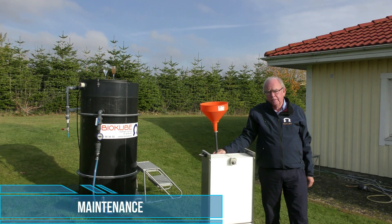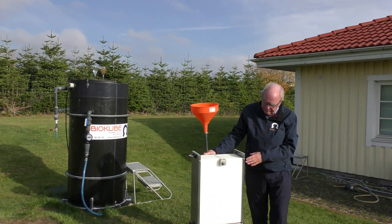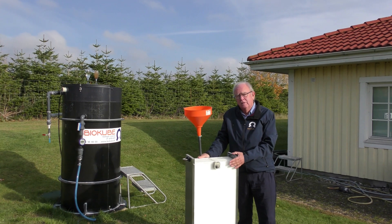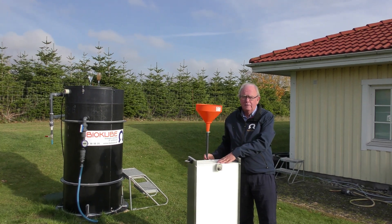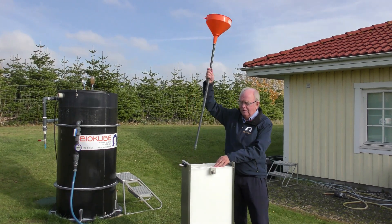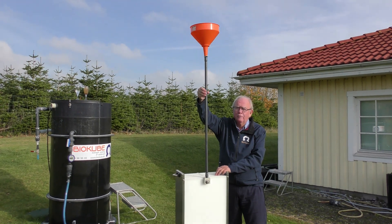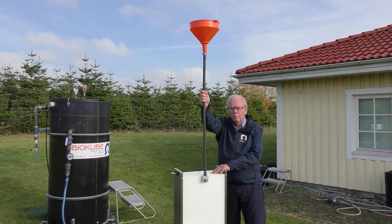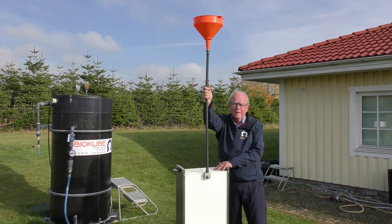What is the service involved in maintaining your BioCube ultra clean system? Over time, the small holes in the membrane will begin to clog. To remove the clog, you add bleach — a standard household product — and fill up the membrane with bleach. You let it sit for two hours, and then your membrane is free to be reused. That's the only maintenance you have to do, and it's something you will do about every three months.